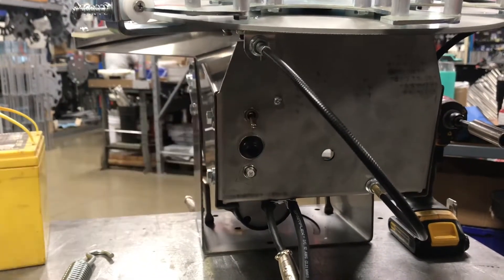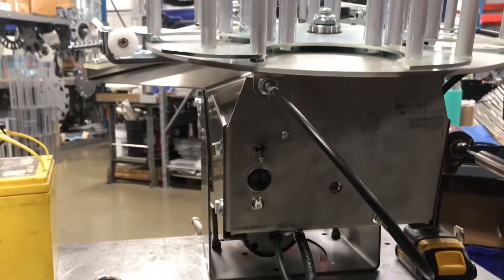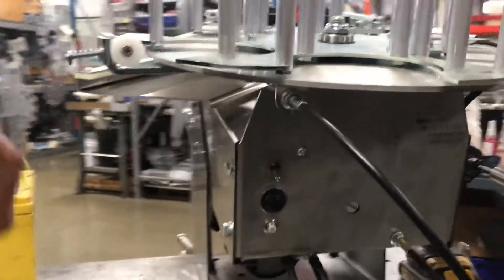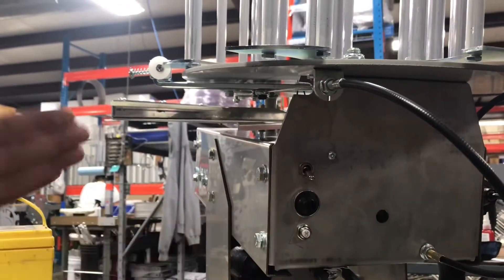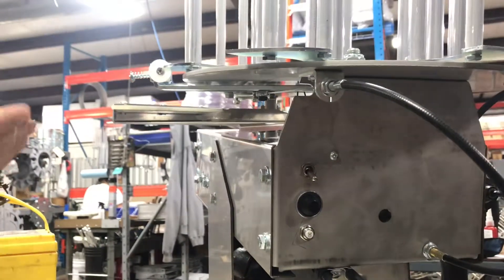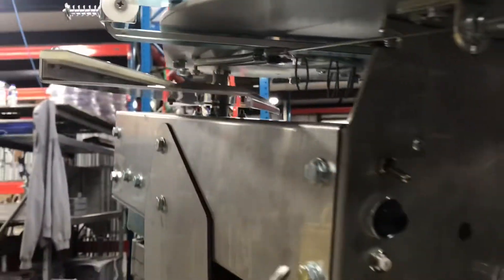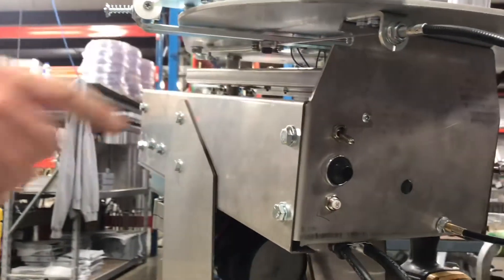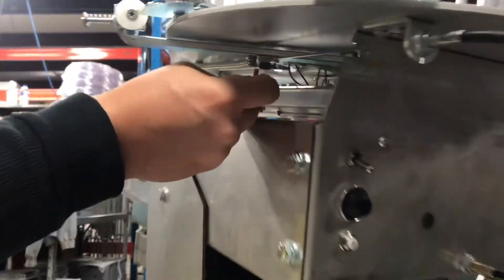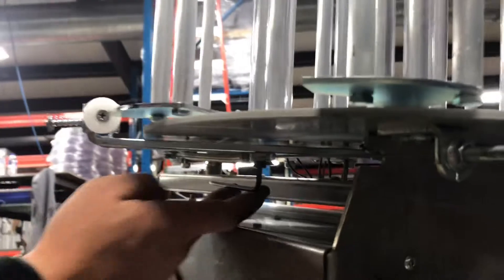With the toggle switch down and power hooked up, I'm just going to bump the motor. Notice how this arm is going back — there are two springs pulling it that way and we're trying to relieve the tension off those springs. Now that it's all the way back in its stroke, the springs have relieved pressure and that lets us get to the bolt more easily. Since I've also moved the motor crank, I can now push this arm forward and easily get to that Allen wrench right here. With the Allen wrench I'll loosen this bolt, which will allow us to take the front part off the cable.